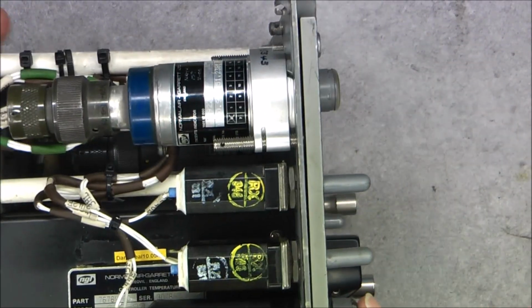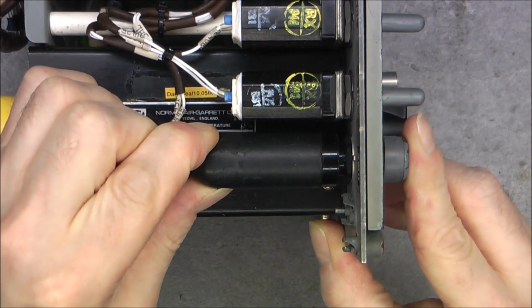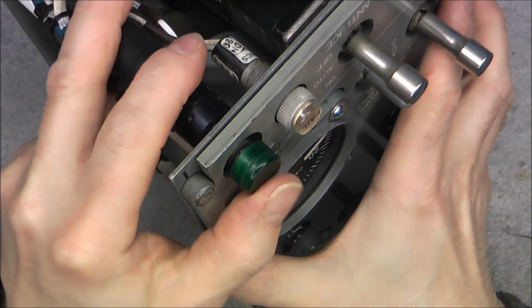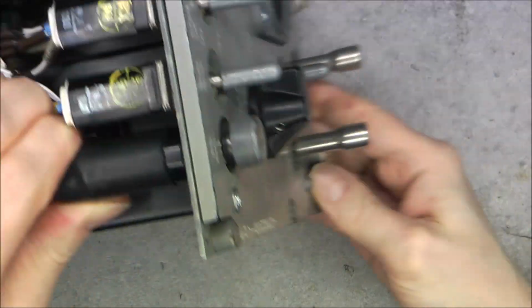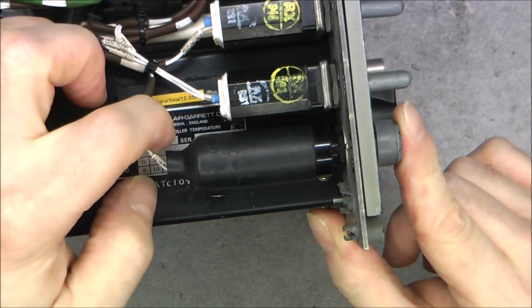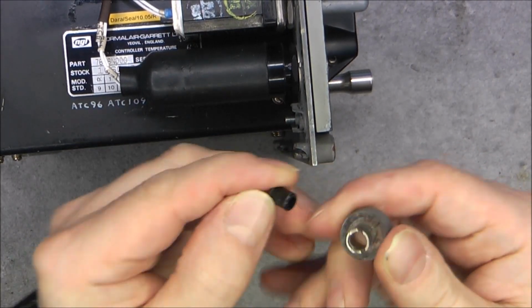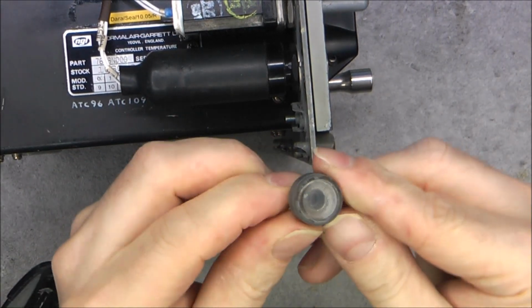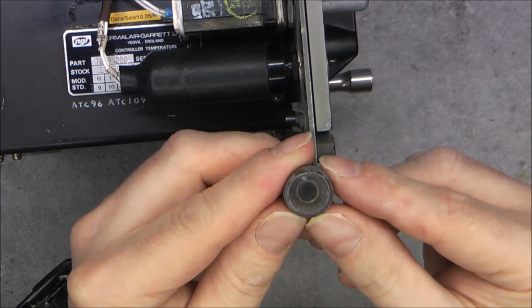About the buttons here and lights, you can see for some reason they did apply some heat shrink all around. I am not sure why, but it is the same for the other one here at the bottom. So this is a regular light and push to test function, I believe, but this one for some reason looks like they did take a light indicator, but they are only using the push button feature of it because you have only 2 wires, and if I pull on it, here you can see there is no lamp inside, there is actually a plug instead of a lamp. And it is clear plastic on the top only because the paint did come off, but originally it was painted in grey, this thing.